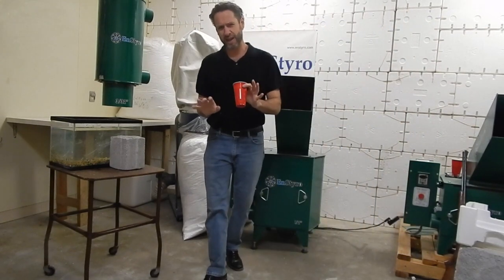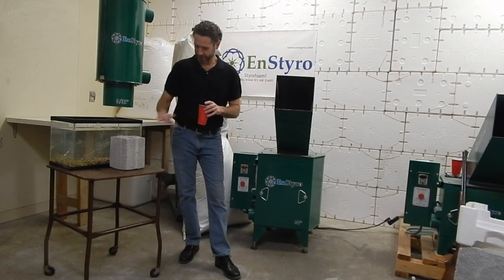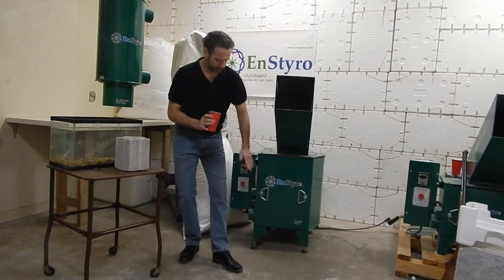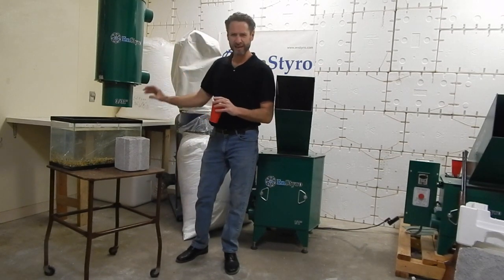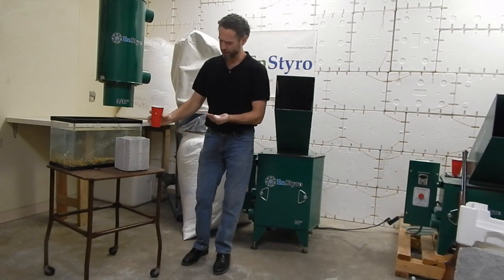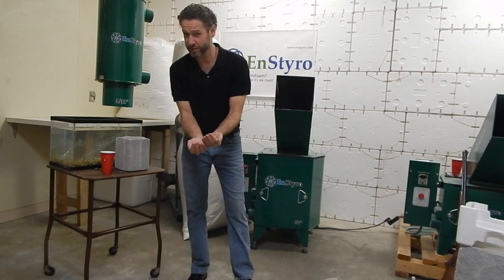Now what we're primarily talking about today is the use of foam in concrete — styrofoam as a concrete aggregate. This is a styrofoam concrete block right here, very light — we'll show you more of that later. What we do is put a screen in here, say a quarter inch screen, maybe a 3/32 inch screen over here, and we put the foam through the shredder and through the separator and we get a very precise size range of foam. It's very small, but even the very smallest is separated out, and there are good reasons for that.